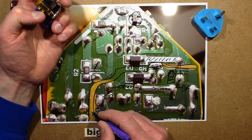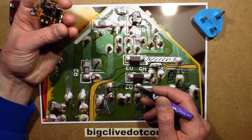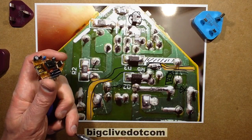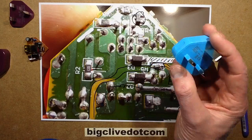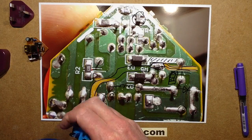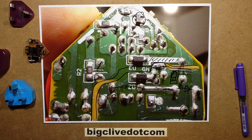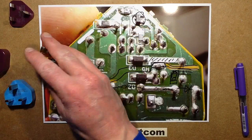The thing that lets it down — it could have done with better isolation and better spacing, and I think they could easily have fitted that in with just a bit more effort. What really lets it down is that resistor placement — to me that's just an instant fail. I wouldn't trust using something like that; the isolation is virtually zero. I wonder if that is the reason it was taken out of circulation. You see this so often with cheap Chinese stuff — they start with good intentions then blob a component in that completely blows through all the safety. Not surprised they were withdrawn, just for those two reasons: the unclipping, but most importantly the lack of proper isolation.